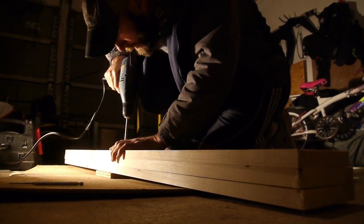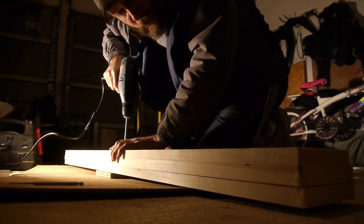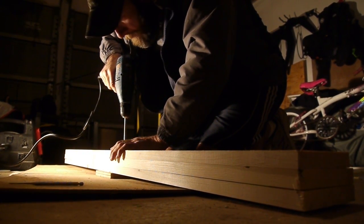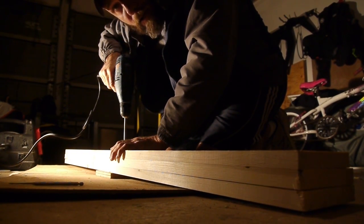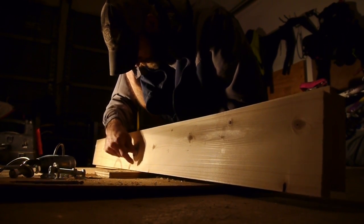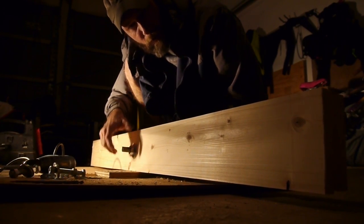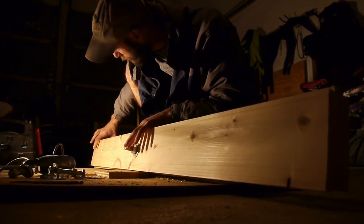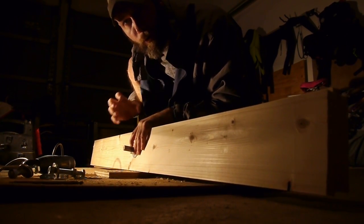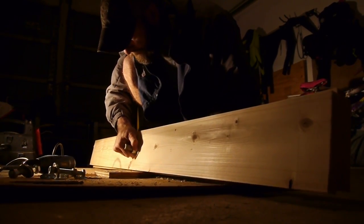So those fibers are exposed, they'll soak up the glue and help bind this together. I'm going to mount this down to my table, and when I get ready to duplicate it, this is going to be the center bolt and it's going to hold everything in place. I'm going to have two more bolts — they're already in my table and I've got to mark this and then drill it. I can tighten this down after I put the glue on. It'll help apply a lot of pressure right down the center, especially having a bolt here, a bolt here, a bolt here, and then I can put my clamps around it. That'll really apply a lot of pressure and allow me to get the glue to stick.